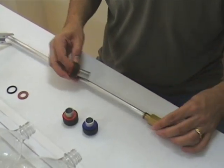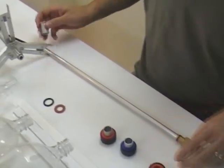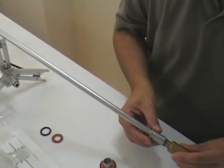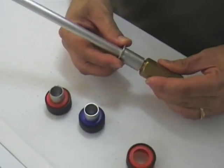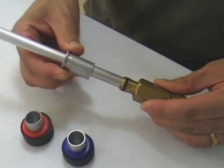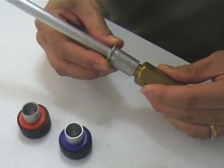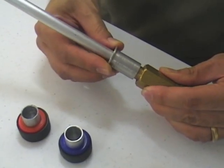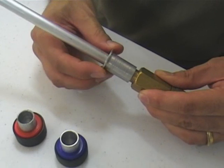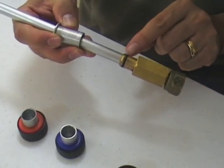The launcher is also now equipped with new nozzle seats. These nozzle seats were designed so that when the nozzle fits on them, it has some amount of movement which allows the bottles to stretch and move around. There's quite a tight tolerance where the o-ring is, but the nozzles are allowed to swing a little bit around that — you can just see the little raised section here.